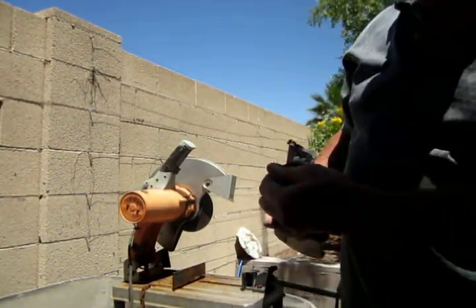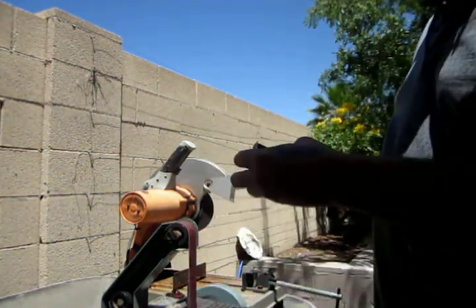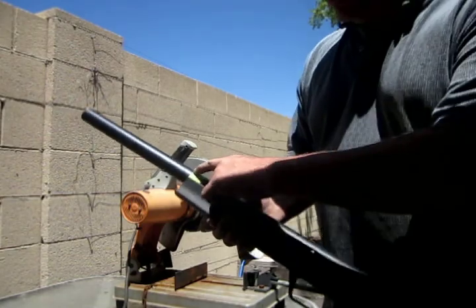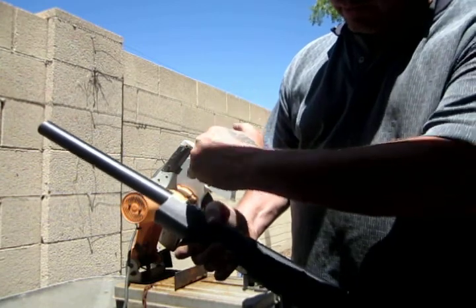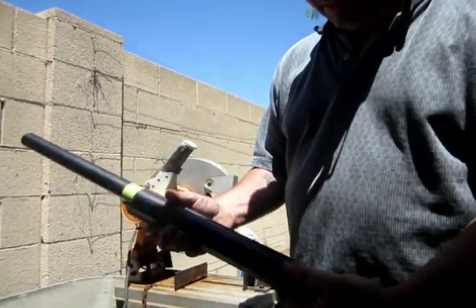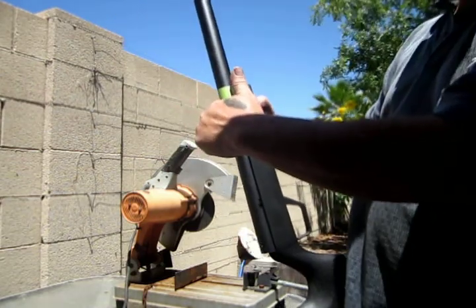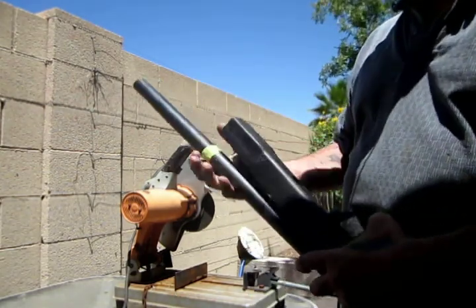Alright, not the prettiest — I'm going to go clean that up on a little belt sander. Now that we've got it lopped off, we're not going for fashion here, we're going for function. We're going to sand the edge and mark our tube and cut it off next. We've got the end of the tube marked just a little bit past the fore end. Everything's been gutted out of this with the exception of the gauge and gauge block, which allows me to keep everything lined up. I'm going to stuff a wet paper towel down through it to catch all the metal shavings, then push it back out when we're done.